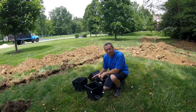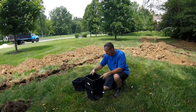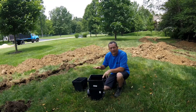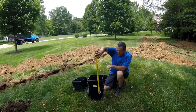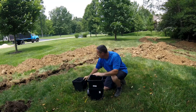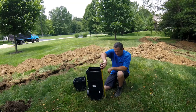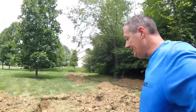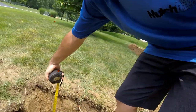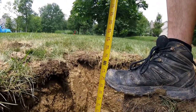The real trick is to find the right height for the catch basins. These are catch basin risers — they fit on top of the catch basin to extend the height to your grate. These come in six-inch increments, though other increments are available. You'll measure down to where your gravel is and up to the height of your trench, and use your risers to get to the height you need. In my spot, it's about 24 inches — measuring by tape measure, we're at about 23 inches.